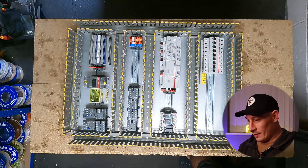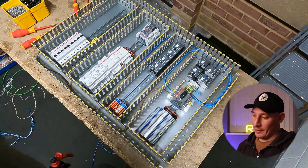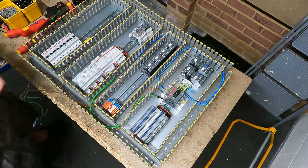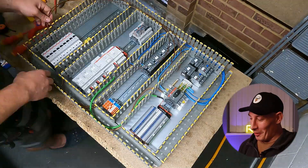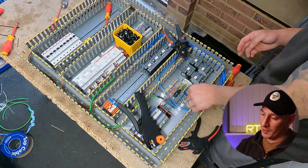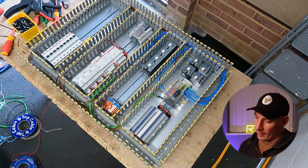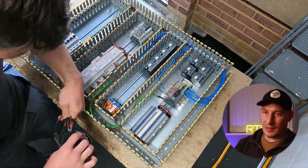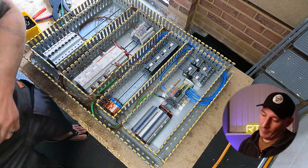Here I'm just getting the distribution circuit terminal blocks and labeling everything ready to start wiring. I always start with the main supplies — you can see the thicker cables of the neutral and live there. Then the next thing I do is put in the KNX cable, that green cable that buses along to all the components, then doing all the neutrals, and then one out of the MCBs to start feeding the live feeds to the relays, coming off that distribution block in the middle left.